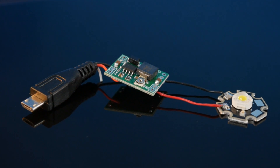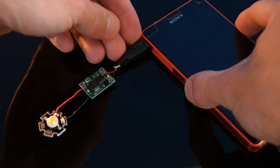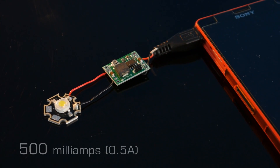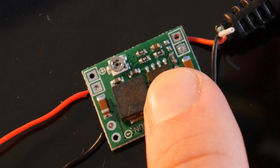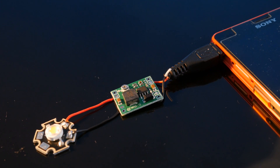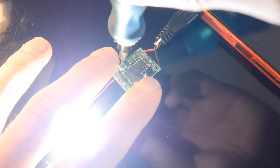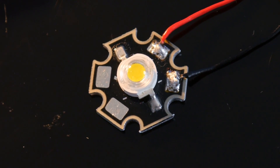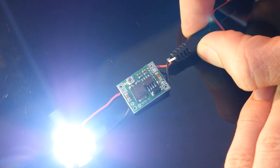So you're probably wondering what on earth was going on with that LED. The reason behind it flashing is because the phone is being very smart and detecting that too much current is being drawn compared to the USB spec, which caps out at 500 milliamps. This is because we haven't properly set the output voltage of the step-down board yet, so the LED is drawing too much power. To properly set this is a trial and error process where you have to adjust the micro knob on the board itself in tiny anti-clockwise turns, reinserting it into the phone each time until the LED doesn't light up at all. With this achieved, the knob can now be very slowly adjusted — still anti-clockwise — which will result in the LED lighting up and gradually increasing in brightness. Eventually it'll reach a maximum point and then suddenly turn off, meaning you've passed 500 milliamps and the phone has again cut power. So simply backtrack the turn very slightly, and it should now be set so that each time you plug it into the phone it remains on consistently.